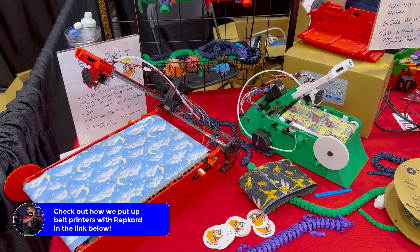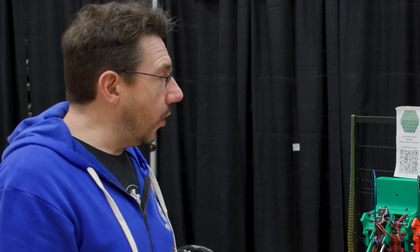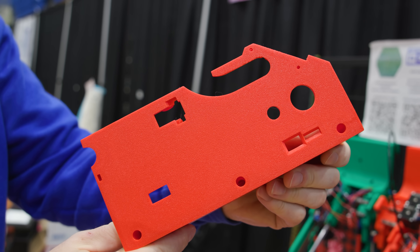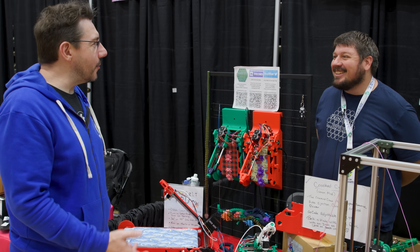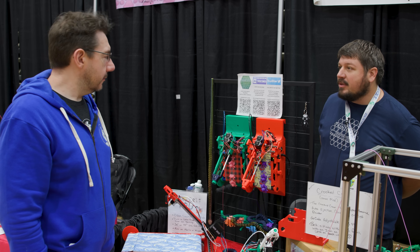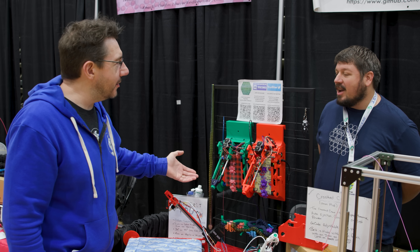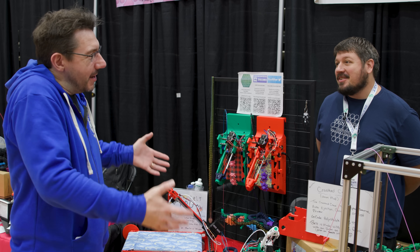The XL, which is in prototyping stages, just Legos together. This is a standard size baby belt, and if you look, it's the same side panel — it just adds another section on. Choose your own adventure printers. What are you using for a hot end on these? These are all bamboo hot ends, but you can also put a Revo with a non-planar setup in there. The bamboo nozzles are not expensive for what they are. No thoughts of putting a high-flow tube on there — you don't need 40 cubic millimeters a second. That would be overkill — maybe on the XXL or something like that.